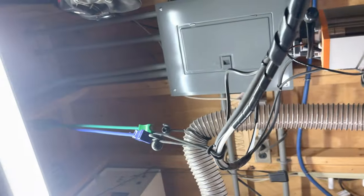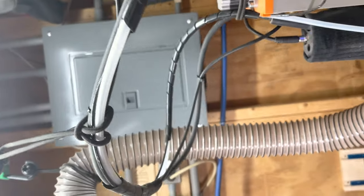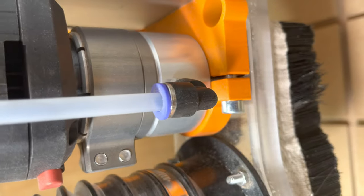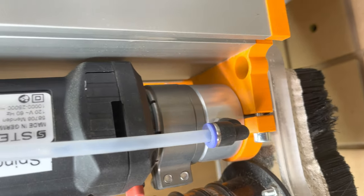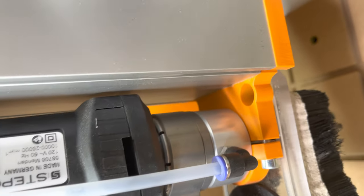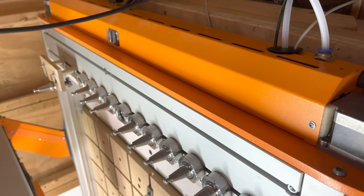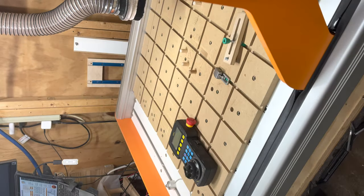This is the output that actually goes to the ATC — it goes up and around. I have everything routed up and out of the way rather than using the tracks. I use bungee cords to keep everything out of the way with some strain reliefs. That air hose goes all the way down and connects to the ATC, which controls the chuck whenever there's a tool change.